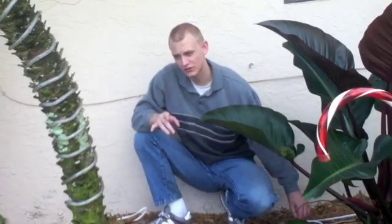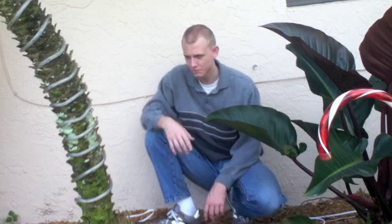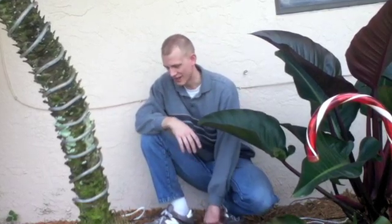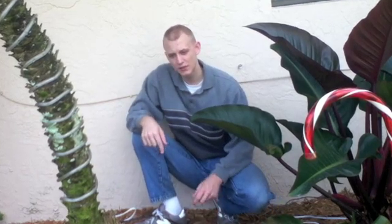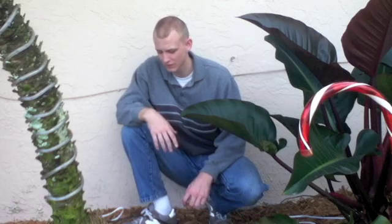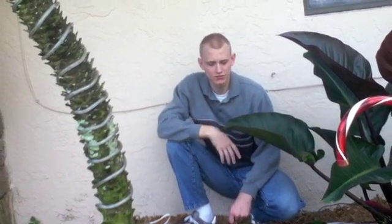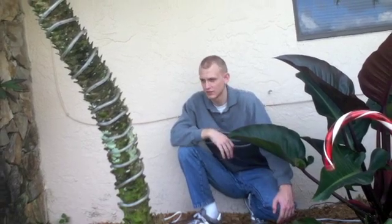Now these are solid state wires. Let me just clarify before I go any further: I am not an electrician or a professional or anything like that. I am just doing this because I can, and I am doing it the way I want. These are solid state wires inside, and they should be able to handle 120 volts - it's the wattage and the amperage that they're not supposed to handle. These cables are made from sprinkler wire, made to handle low voltage - 24 volts and lower. I plan on using this wire on another project that is 12 volts DC, which is going to be a car project. That being said, I am not pulling a lot of wattage at all. I have had these on for over 7 hours and nothing is getting hot, so I'm keeping it the way it is.